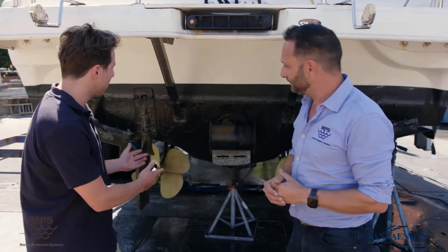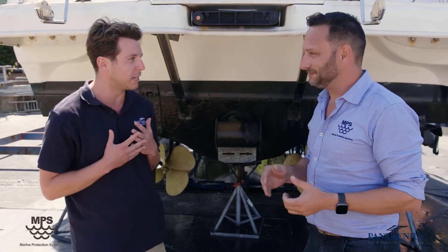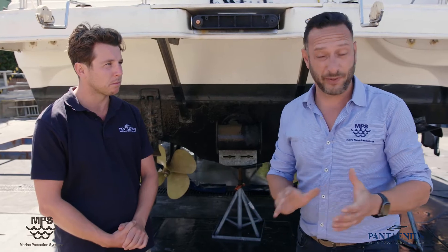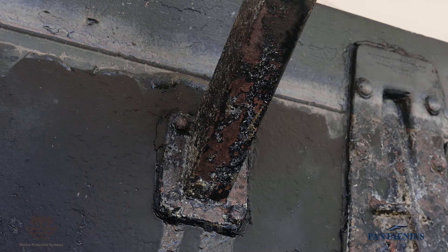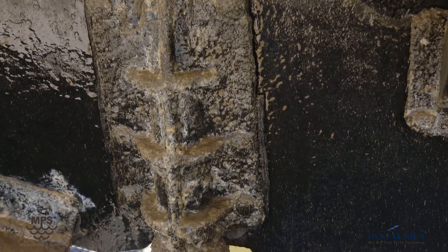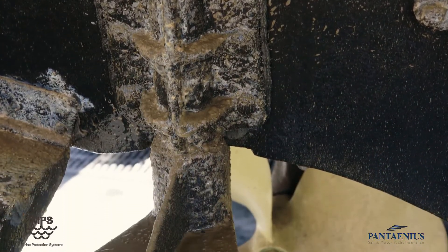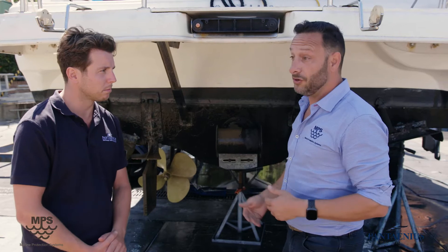On this boat in particular, I see a little bit of corrosion that's set in. Can you explain how this has happened and what boat owners can do to prevent it? This boat has only been in the water for a short period — just under a month. The coatings are already showing signs of damage, coating disbondment — what they call cathodic disbondment. The anodes are working pretty hard on the trim tabs, and coatings and growth are already up. If it hadn't been lifted and maintained at short intervals, it would have been a big problem. It's vital to keep an eye on your boat, have a diver swim past, or have a boat manager monitoring all these vital components.